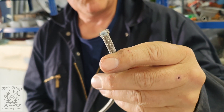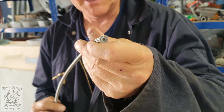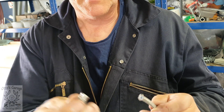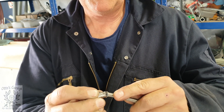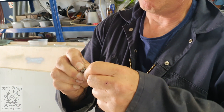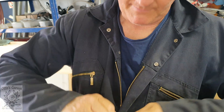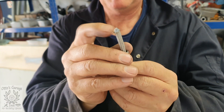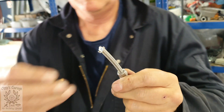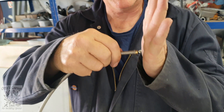I've just cut this one and you can see where the end of the wires are frayed a little bit, and you can see the PTFE in the middle. Just make sure you've got no contamination down the pipe. Those little wires are what your knurled nut has got to go over, so that's the first thing you do before anything else - feed that nut over those little wires, make sure you've got them all into the fitting. When you push it back there might take a little bit of doing but ultimately it'll push those wires back - that's not a problem. Then we can fit the olive over the top of the PTFE line.